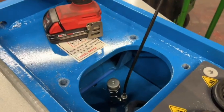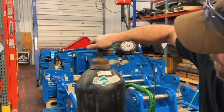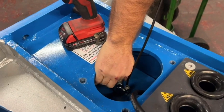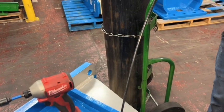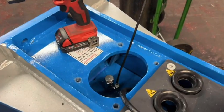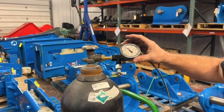At that time, make sure that this bleeder valve is closed. This valve is closed. We'll open our nitrogen up just in case we need to top it off. Now we can turn this thumb wheel in and we should get a reading. Our nitrogen pressure should be between 142 and 200 on this, and our gauge is showing right at 200, so that's good.